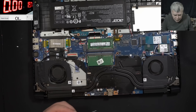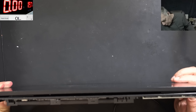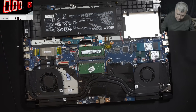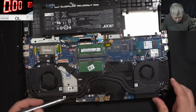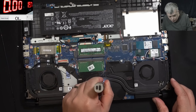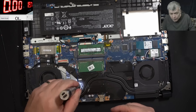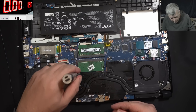I want to check the VRAM before going further, but I need to take out the heatsink first. Hopefully it's not the CPU. If it's the VRAM or the GPU, we can disable it and still use the integrated graphics. But if it's the CPU, then the CPU took like 19 volts with a bunch of amps and there's nothing we can do.